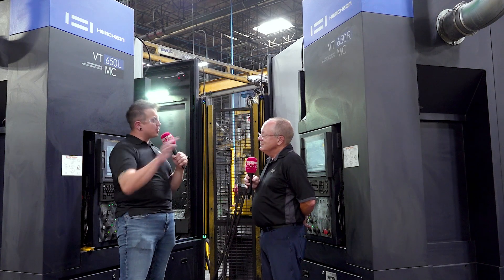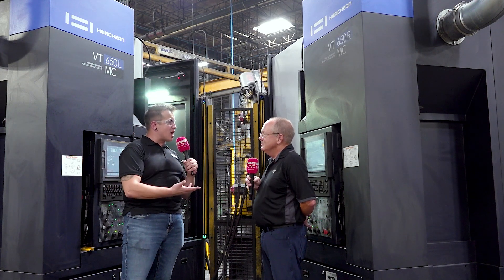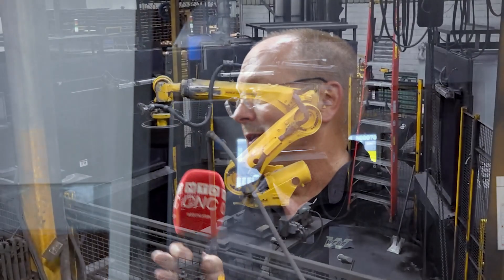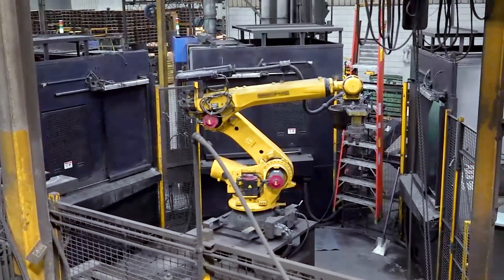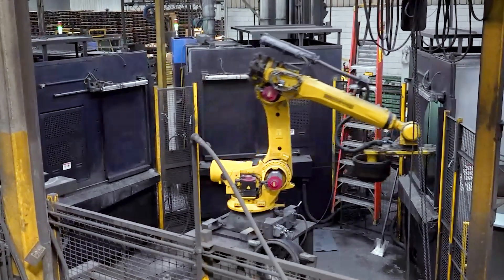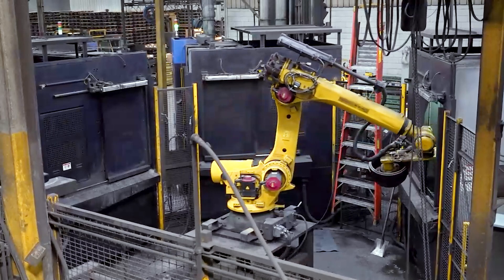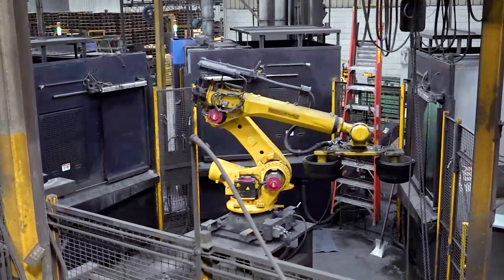Now that you've got that, you don't have to worry about wear on the machine. How is the rigidity — when you're programming these, do you have to pull back because of that change? No, we're much better for the same exact reason. The rigidity of these machines has helped us out quite a bit, especially from the automation side. When we're looking to put these machines in automation, we want the ability for them to stand here and run pretty much without an operator, and the rigidity allows us to have automatic gauging inside the equipment.